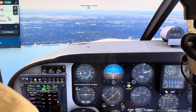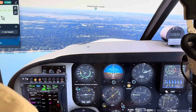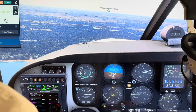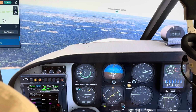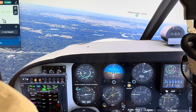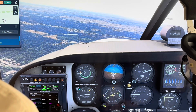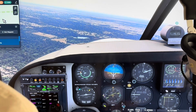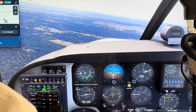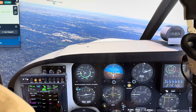Now the gas that remains is going to be left. You'll be able to see the gallons remaining in two places. One is the gas gauge, at which there are two, because there are 30 gallons of fuel in each wing, a total of 60 gallons. And this airplane burns about 14 or 15 gallons an hour. Pretty typical for a six-cylinder engine, big Lycoming.